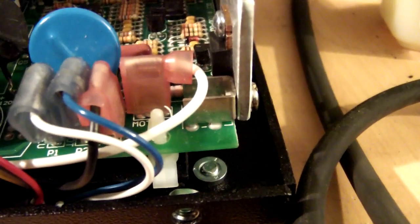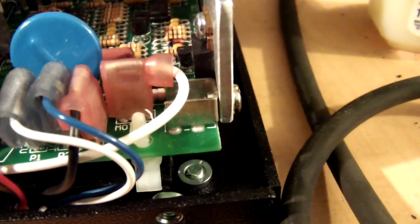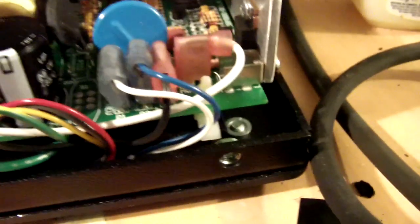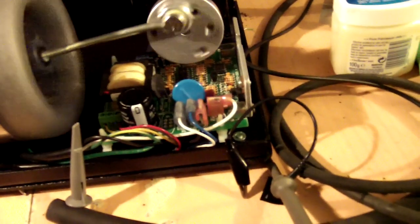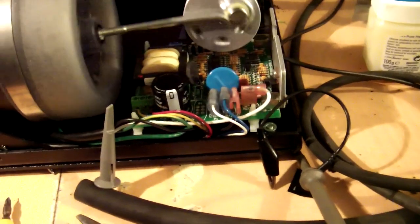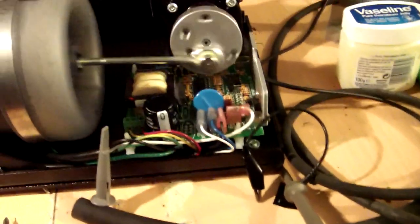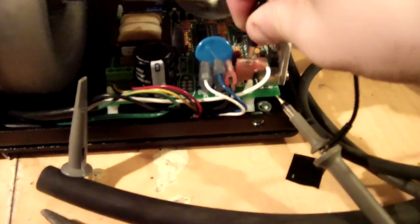I don't recognise the chip. OK, I will find the motor negative and hook up my scope and see what's going on with it. Of course this is actually colour coded — red ones for motor, green ones for power. I also got a bit of a nasty shock off this thing because I forgot to disconnect it from the mains. One nice thing about having an isolating transformer hooked up — so I haven't got to worry about forming a ground loop and blowing my scope.